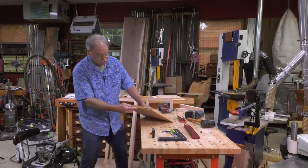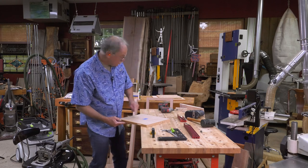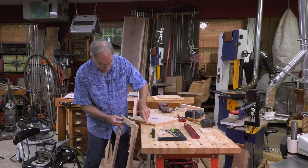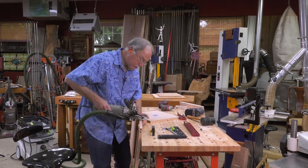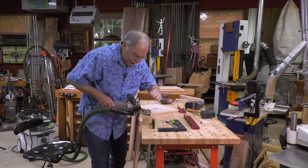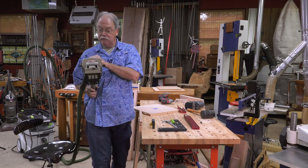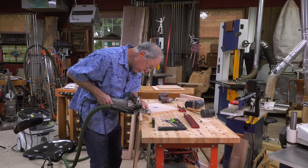And that's on dust collection, and that just cut that slot. And I have marks corresponding on the pieces of wood, like this right here, to butt into that. Watch what happens here. Bring that up. Keep the fence, which is right here, down to the wood, and the face, which is right here. You can see the cutter. How about that? That makes that a round cut.